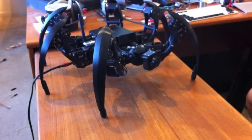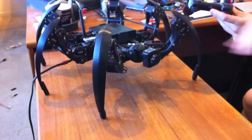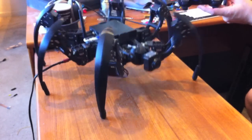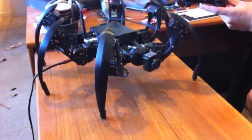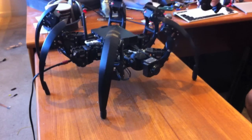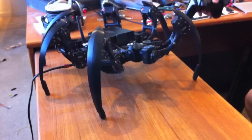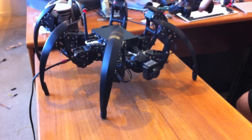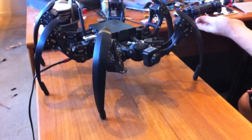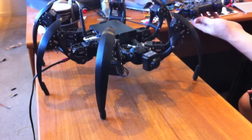The controller does pretty much all the same stuff. I've implemented different gaits. There was a twitching issue that I haven't been able to fully test on this particular unit to determine if I eliminated it. But one thing you might notice is that without the shaking it's much smoother. The camera still needs some calibration so it's not working completely correctly yet, but that's just a software issue — the mechanical design I believe is all set. The motors have four times the resolution with PID loops that I very crudely tuned, but it seems to work much better and it's much more smooth.